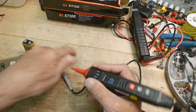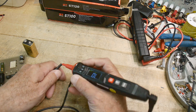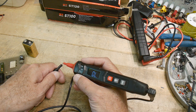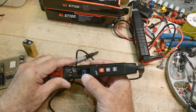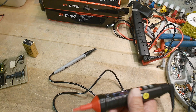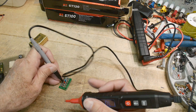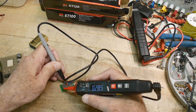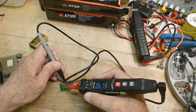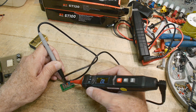It also can measure continuity. It's not latched — it's fast but not latched. There's a little LED that lights up which can come in handy. There's a diode test as well — let's put it on ground and go to this one: measuring 0.28 volts. This one is 0.57 volts, this one is 1.6 volts, and it won't measure the blue LED — the burden voltage is probably 3 volts on this machine.